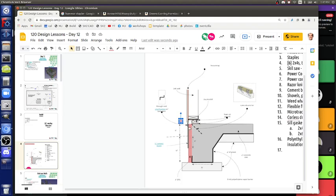That's maybe a disadvantage of doing this technique, with the insulation on the outside, because typically people do it differently. They wouldn't put the insulation at the foundation step, which means they would have to add it later. But because this insulation goes underground, we had to do it before. We're using the shallow insulated footer, but otherwise we'd have to dig a big trench here, and we're saying, okay, let's avoid the heavy equipment. When we put the forms around the foundation, we already did the insulation at that point. So the insulation is already there. Now that little sliver is what we have to cut off the existing insulation.